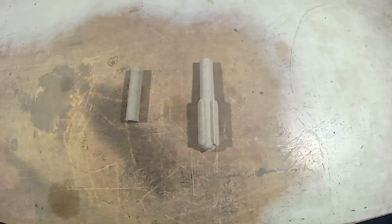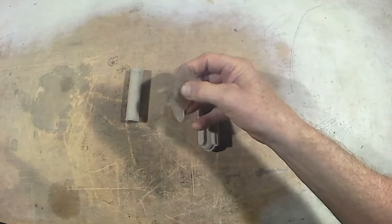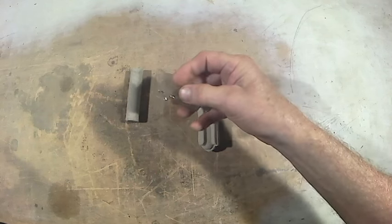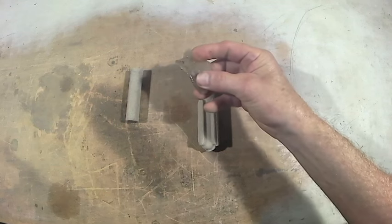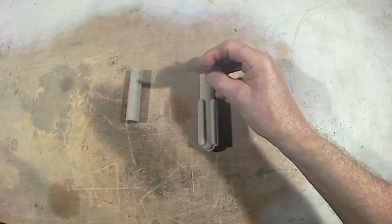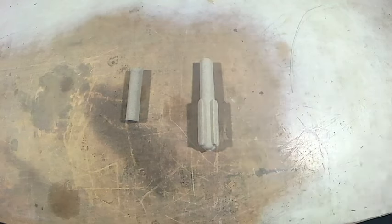But you're going to ask, why can you harden a sodium silicate core without carbon dioxide gas? It's because sodium silicate contains water. And this is what we've got. This is sodium silicate. It's been spilled, that's really rubbery. It's been exposed to the atmosphere, it's dehydrated. And that's what holds your core together.